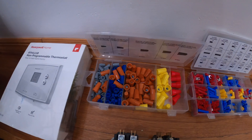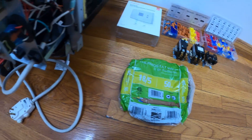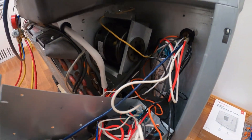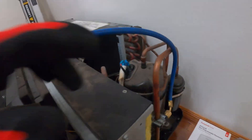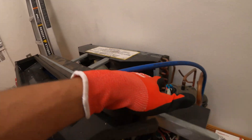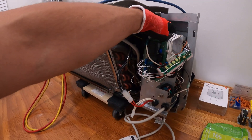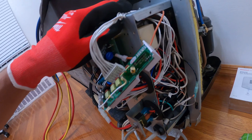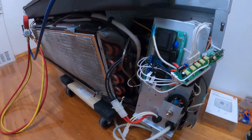So I have a thermostat here, some wire nuts, spade connectors, contactors, relays, thermostat wire, and we do have a transformer right here. I'm going to reuse that and reuse the capacitors. The idea is to get the evaporator fan motor running, our compressor, and our condenser fan motor through our thermostat when we call for cooling — and basically rewire this whole thing my own way.